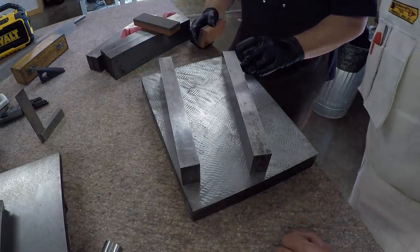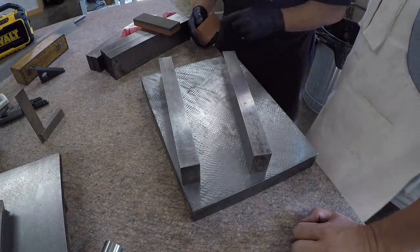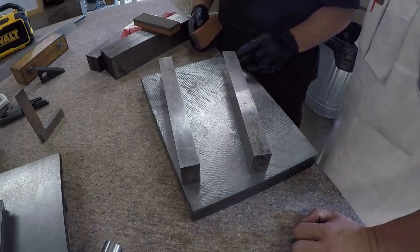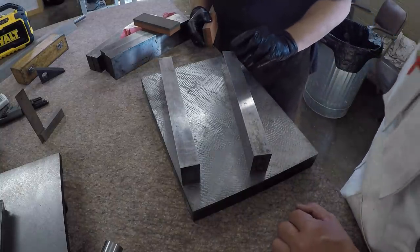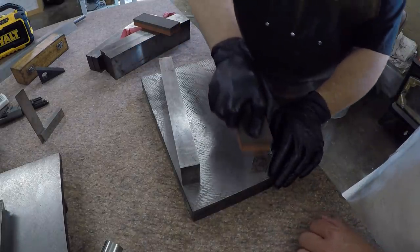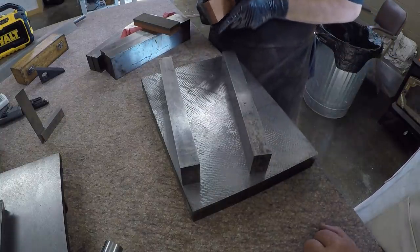Yeah, and interestingly enough, as soon as I put the stone on here, Adam, the very corner I felt it. I felt it in the stone, and there was a little rolled up corner burr on this one. You wouldn't test that part of the parallel, because you never saw the indicator there. But as soon as I set that down, you could just feel it, and I felt it cut right off. That's the beauty of these stones. It won't touch anything but an irregularity.